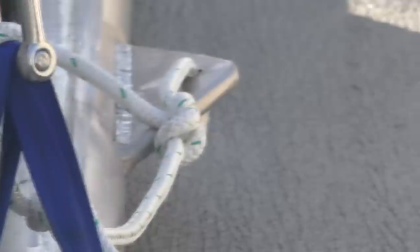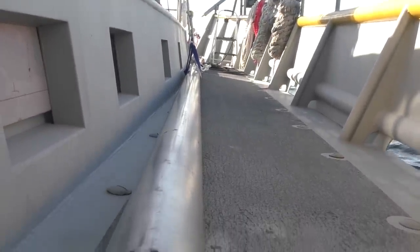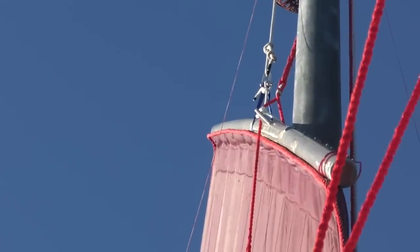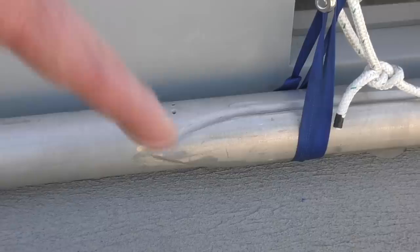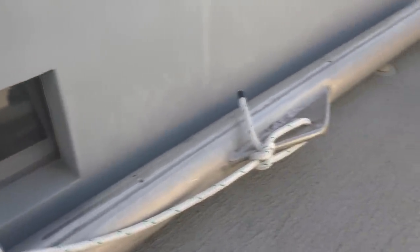Welcome to Sailing Vessel Seeker. In this episode we're going to cut up our yard and reinforce it, make it stronger. We're also going to move the attachment point and put some more reinforcing on the top as well as inside of it. You can see a bend - it's actually bent upwards on the ends, but with the sail hanging on it and being pulled up it bends down. I'll extend the doubler out a little bit here so the pad eye or lifting point isn't so close to the end.